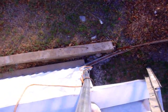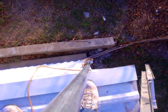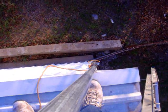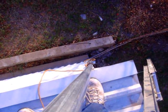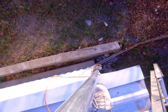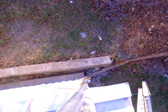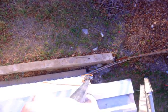Hello, I'm Scott Brown, Green Wind and Other Home Energies. Looking down the pole here — it goes up straight and then bends off this way. This has been bent, and the pole is exactly six foot up from where I'm standing on the roof — that's a bit much for this conduit. We had some high gusts, saw one at 60 miles an hour — that's probably what bent it. With a four-foot nine-inch prop on it, that was enough to seriously bend this pole. I tried to straighten it out. Holding a piece of plywood flat to the wind on a pole can fall and hurt things — you need a furling mechanism.